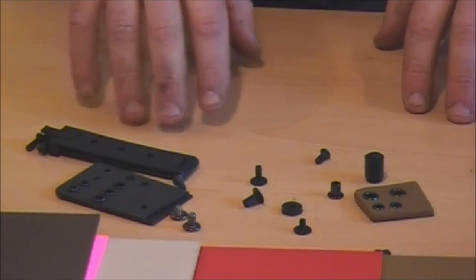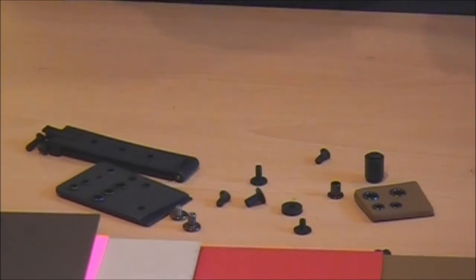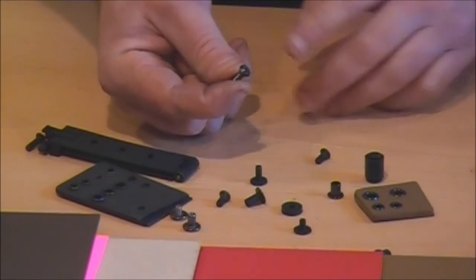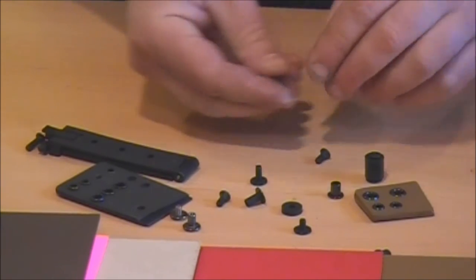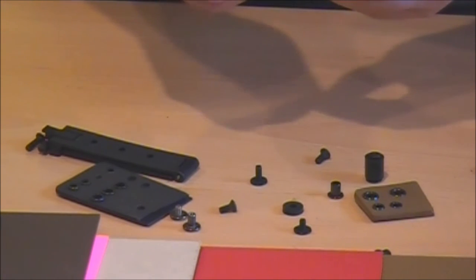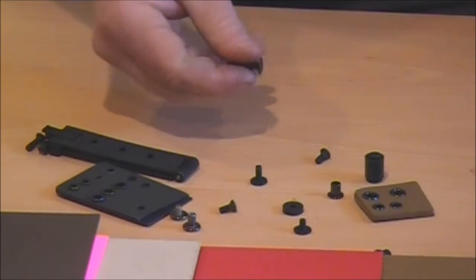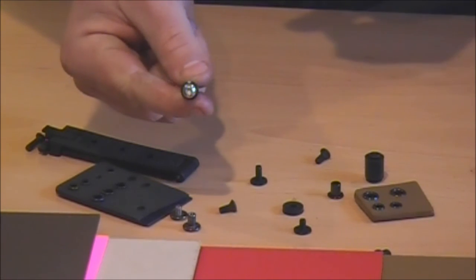Other options for nuts and bolts, again all these are specialised bits, designed and made for the Kydex Tek-Lok system. Knowing that they're standard 8-32 thread, we can buy, this is a standard 8-32 thread dome head Torx bolt, black and stainless. This will screw directly into all of these posts and gives you a different look. We can even use another one on the other side. This one being shiny stainless, as I say, different look again.